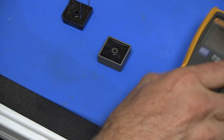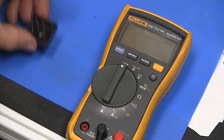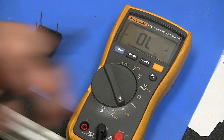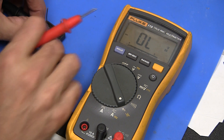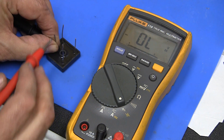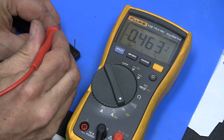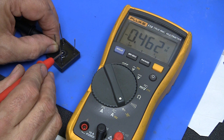Let's talk about how to test these things. To test the bridge rectifier, you'll want to put your multimeter on diode mode, and you'll want to take your negative lead and put it to the positive — the odd lead — and then touch either of the AC legs. When you do that you'll get a reading, and on mine it gives a little beep. It says .463, and it should be between 400 and 600. So that's a good one.